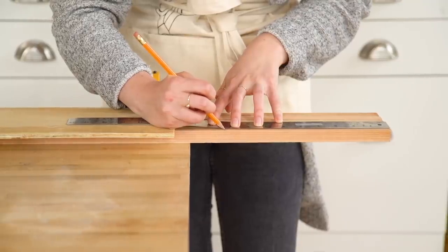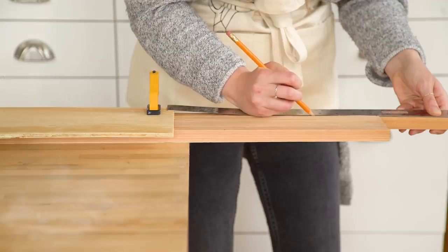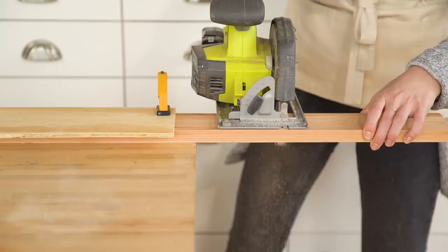Next up I'm going to be tackling this galvanized farmhouse plant stand from Pottery Barn. This one retails — hold on to your seats folks — $263. It's not going to cost us that much to make. I'm going to start with 3/4 inch by 3/4 inch pieces of cedar wood — like a square dowel. I got five of them for $3.30 total. I'm cutting 9 and a quarter inch off of four of my pieces, and the remainder of those four pieces will be my four legs. Then I'm cutting four 10 and 3/4 inch pieces off of the fifth piece of square dowel.